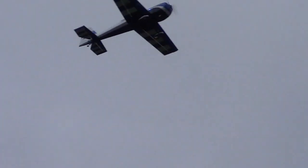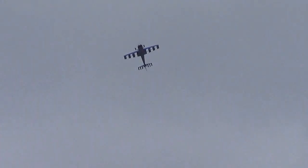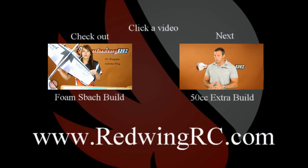This is the hands-off upright pass, and now going right to inverted — pretty darn close. That was my first guess of one ounce and it's real, real close. I think that's going to be our starting CG point.